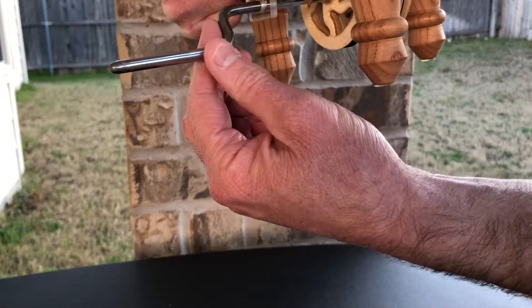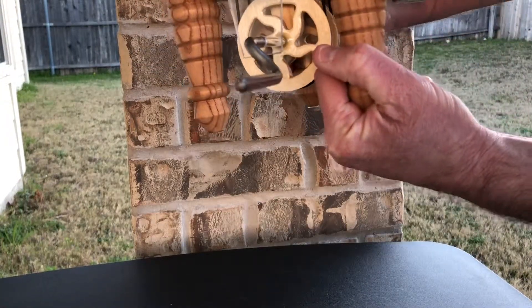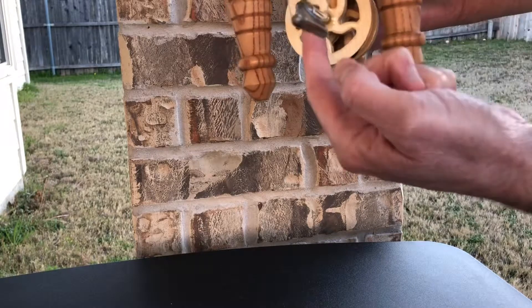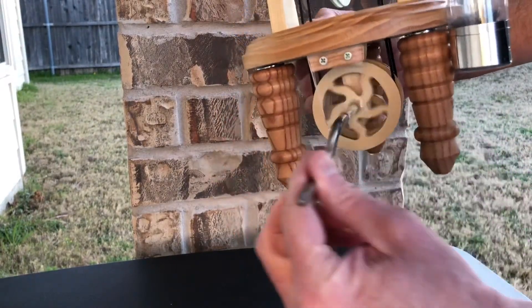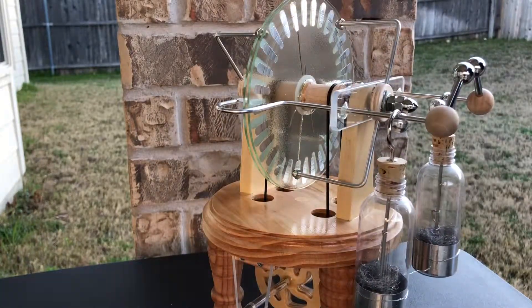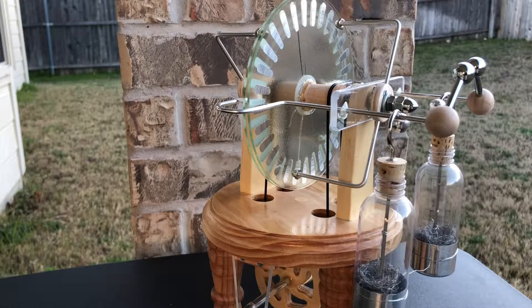These pulleys have a bolt for an axle that I bent with a torch. I took a piece of acrylic — polycarbonate would probably be better and easier to cut — drilled a hole in it, and that serves as the support structure. It would squeak really badly, but you can stop the squeaking by lubricating with wax as mentioned. You don't melt the wax — just rub it on at room temperature like you'd rub chalk, and let it smear on there.